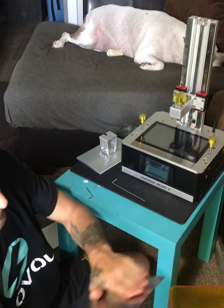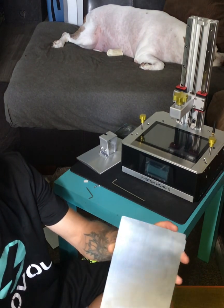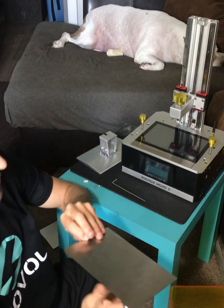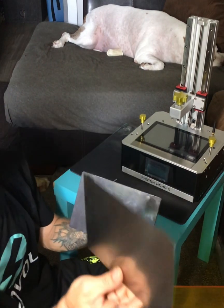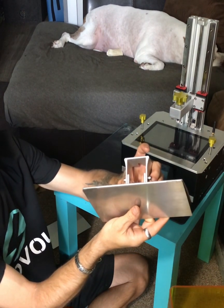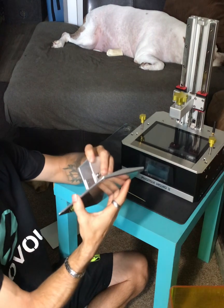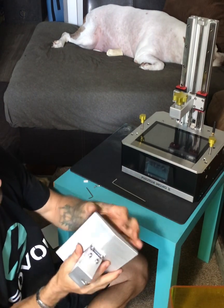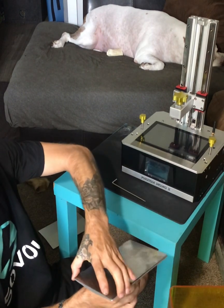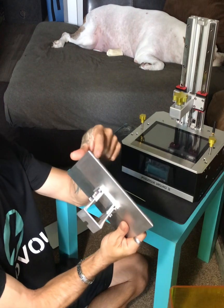and then there is a side with lines, which adds a little bit of textured groove. You're going to want this side facing down to your FEP, and you want to make sure to put the tabs to the front of your build plate / platform. Kind of line it up, push it in place. Make sure you're not hanging over more than just the tabs.